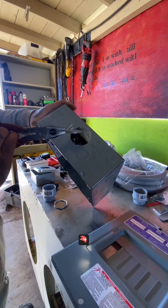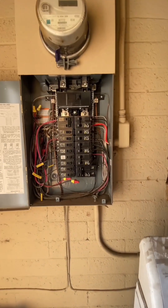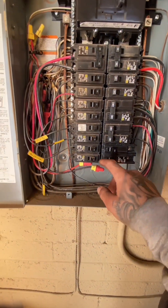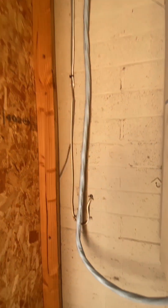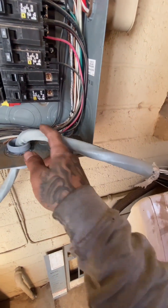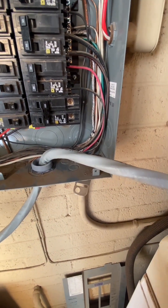Here I punched out one and a half. This is my 200 amp main panel box with my double pole 100 amp breaker. I moved some of these around so I can make this one fit. I pulled it in through — I made a hole up there so I can run it up through the side of the house. Now to take off the jacket so the wires can be exposed in here, bend them up and tie it into the breaker.